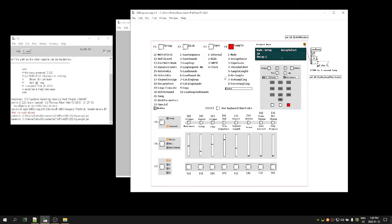So we are going to make a sample. To start, we would go to assign voice, which is command 2, and pick an output channel, then hit enter. We would then go to our input gain and put it up to 20, then hit enter to confirm. We would then set our threshold — we want it low because we want it to trigger as soon as we start recording and it picks up some sound. If you have a lot of background noise in your studio you'd bump this up a bit, but we'll keep it at 1 to ensure we get something.